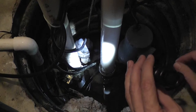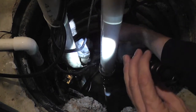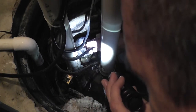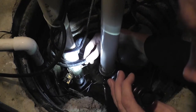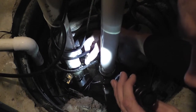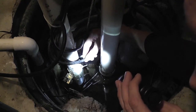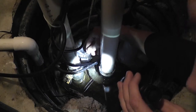To rule out a problem with the switch versus the pump, you'll notice there are two power cords. One goes to the switch, and the other goes to the main pump itself. What you do is trace these back to the outlet — unplug the pump from the switch and plug the pump directly into the outlet. If it runs, the switch is the problem; if it doesn't, you know there's a problem with the pump itself.